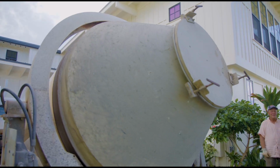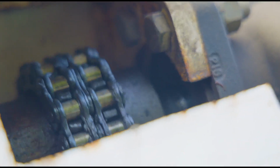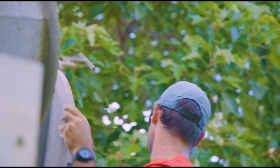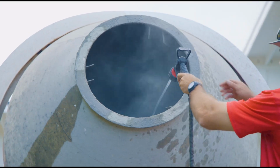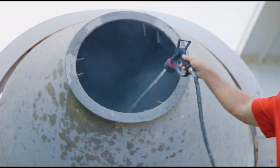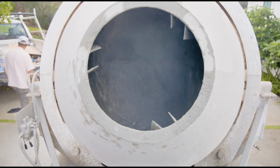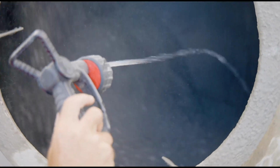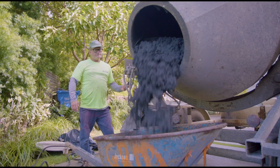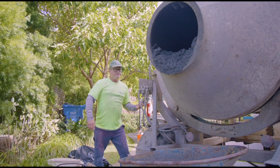So just to add to that interview that we did while we were pouring, just to clarify, we are pouring colored concrete. For this job, it was a little bit of a hard access, and there was also a small amount of concrete. So we ended up using a ready mix trailer, which is a towaway. I purchased the material 1 yard dry, just the sand, rock, and cement. I take it to the job site. We mix on site. And so what we did was we added the color we purchased from a concrete supplier. This color was cobblestone, which is like a light charcoal, dark grayish color.